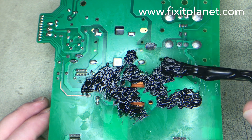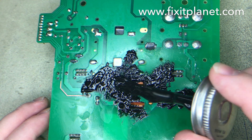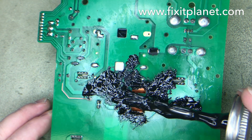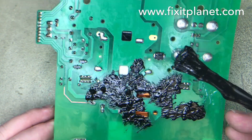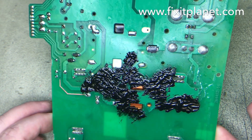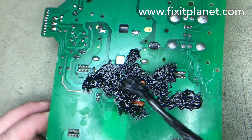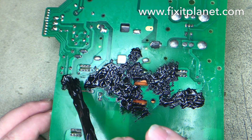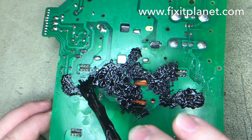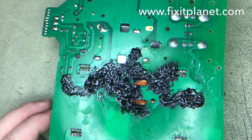Like to say it doesn't look pretty but it does the job. This thing's going to be outdoors, it was heavily corroded, and we did an ultrasonic cleaning and scrubbed it really well, did those repairs on the joints and the traces. Now we're just going to cover everything with this protective coating that should keep the moisture out.